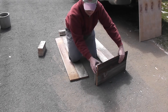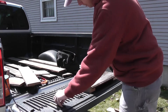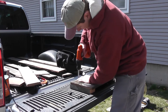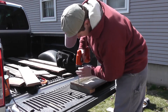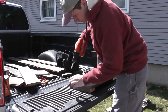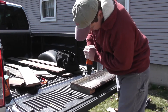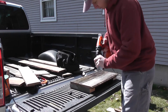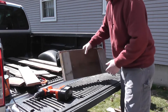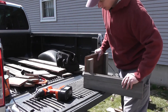I'm going to go ahead and start assembling this. Now I'm the last person on earth to claim that I'm a carpenter or a woodworker — I'm just kind of figuring it out as I go along. I pre-drilled these holes and I'm sinking in some 2-inch deck screws. You've got to be careful, the cedar's really soft — you could go completely through it if you really wanted to. I figured I'd prepare the ends like this first, and then when I go to put the longer board on, it'll be easy to do it.